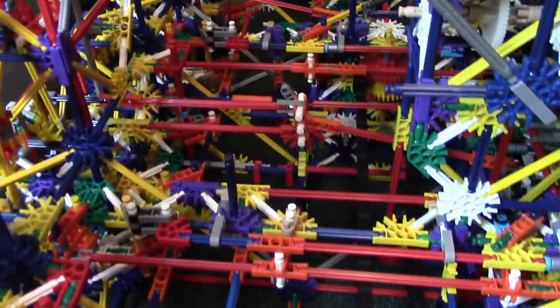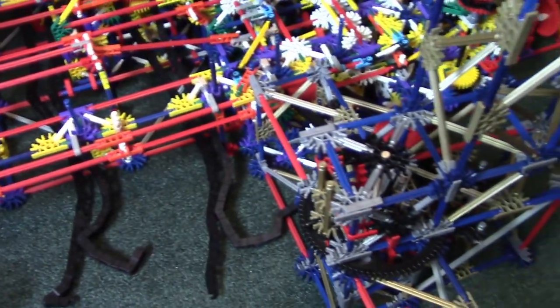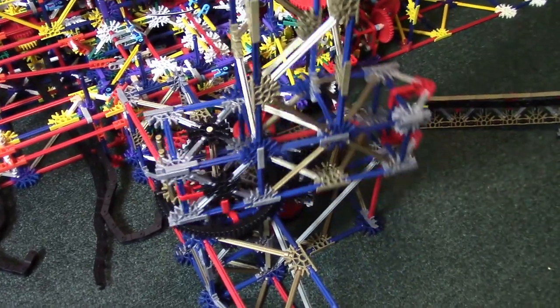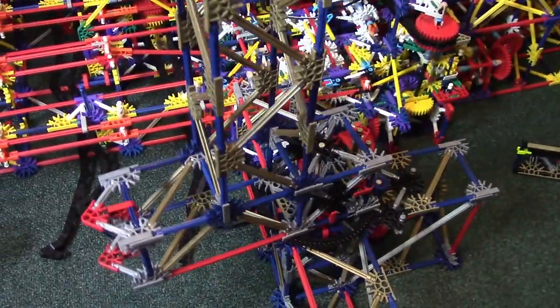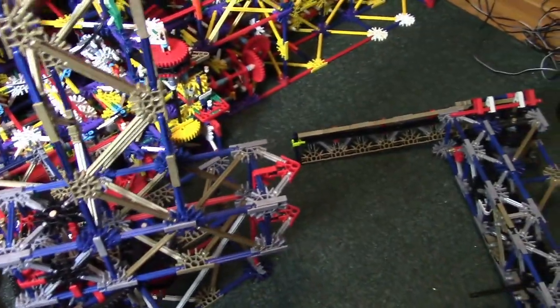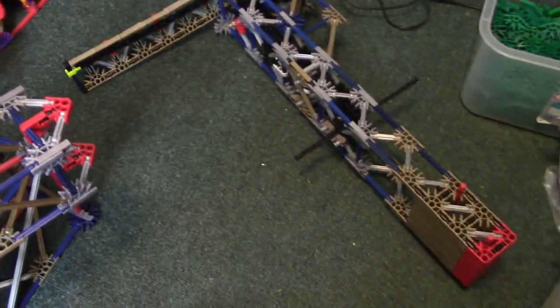So it just goes straight back. I ended up taking out the whole thing that was here — it's back there right now until I take it apart since I won't be needing to make the chain that way anymore. Here, I have part of the robot arm finished. Some major changes from the first version in episode 5: I'm making it be really tall so it goes all the way up to the support beam right here, and I'm hoping that this makes it stable without needing to have a counterweight behind it. This will allow it to save space and be easier to rotate. When I make the next joint, it will be right here and will have a similar structure that goes all the way up to that point, so that part will also be really tall and not require a counterweight like it used to.